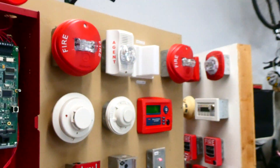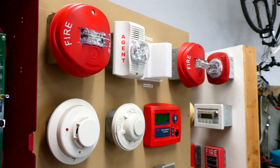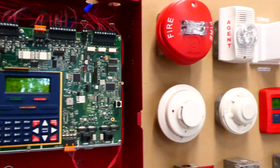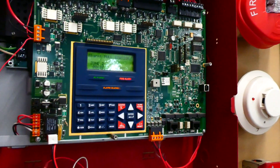As you can see, I do have them wired to two-wire audible silence. I guess it's a programming thing, but since they're both Gentex, I'm able to set them to sync mute, which is a feature on the fire alarm control panel that allows the strobes to continue flashing even when I silence the alarms.